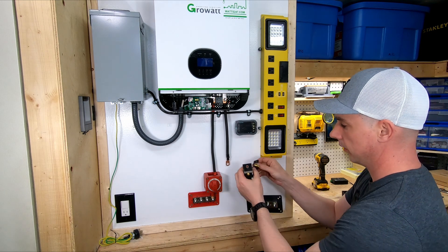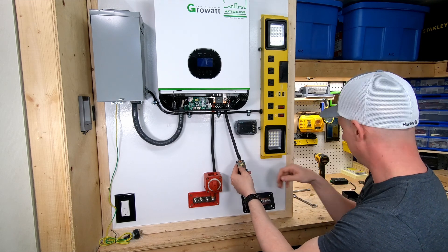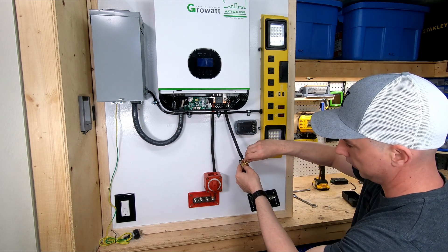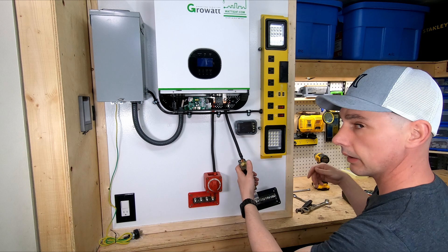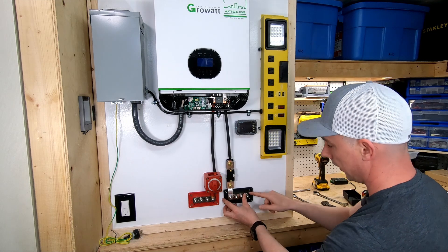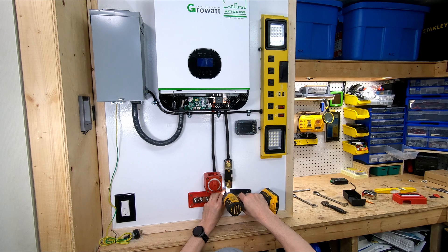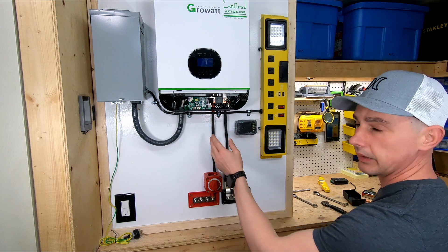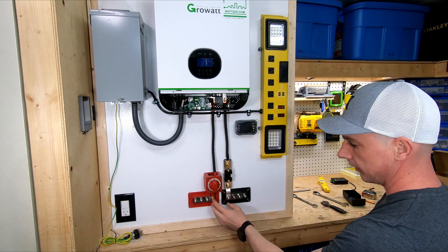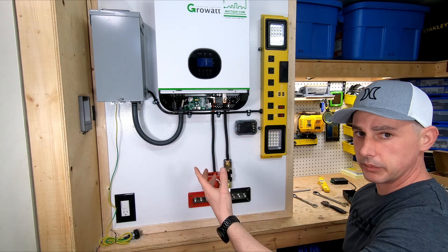So what I want to do is put that in behind, then my washer and my bolt — that looks pretty straight. Now I'm going to mount this up the same way I did the positive. I'm going to secure these cables here so they can't get yanked out, then tighten everything up and add in my shunt monitoring device and I should be good to go.